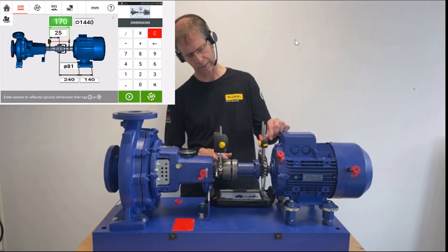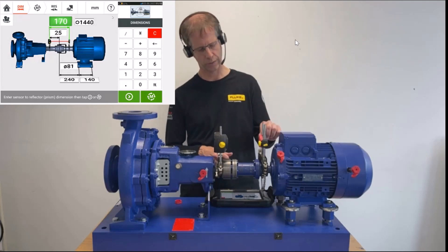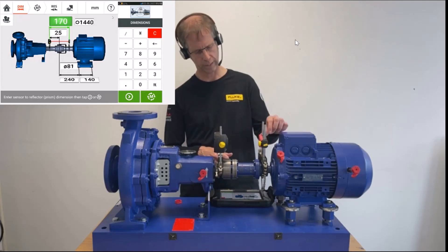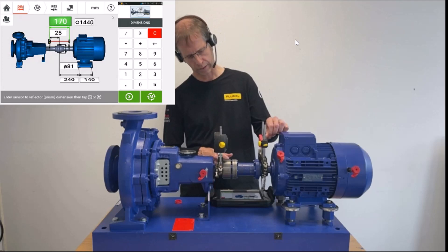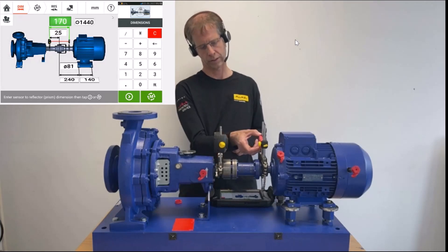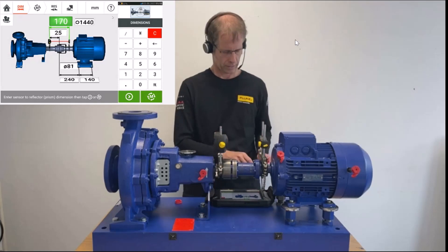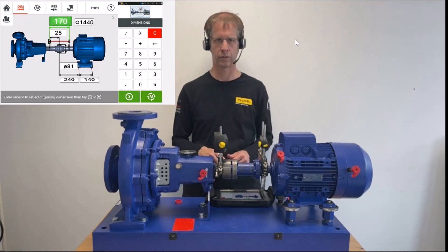I see there is still a little bit to adjust here, so what I do is move the prism with the metal wheel here on my side in order to make the laser hit the cross on the dust cap, centered as much as possible. I take off the dust cap of the prism as well.